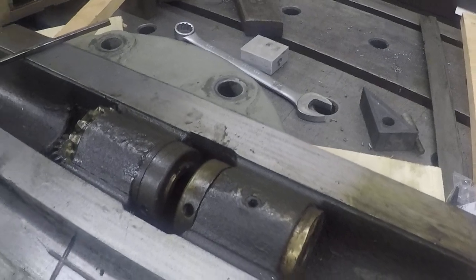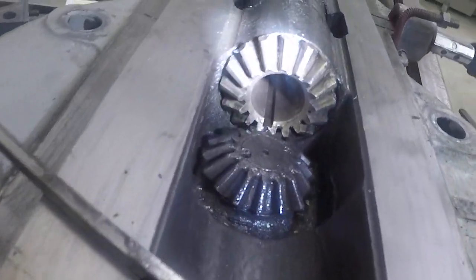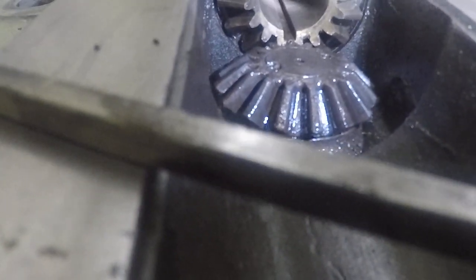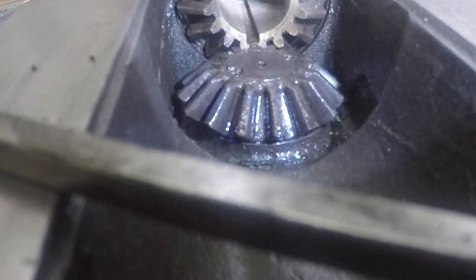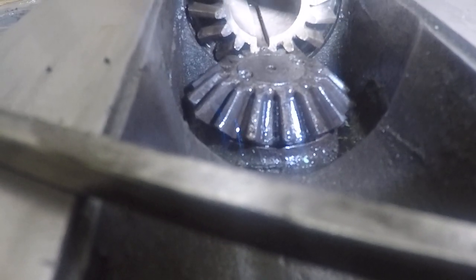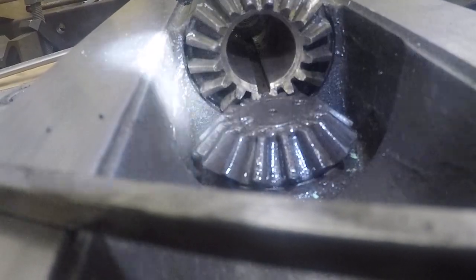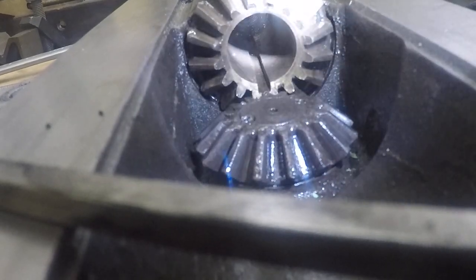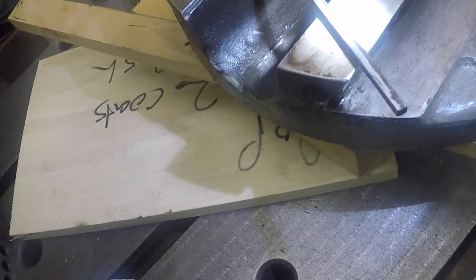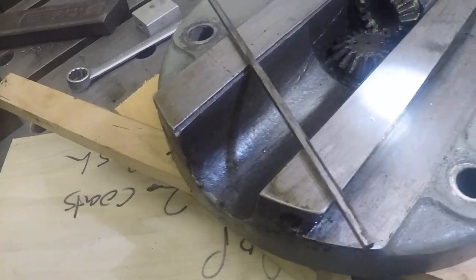The only thing I see holding it — I'm not really sure that's the cause — but it was round, down inside here. You can see the keyway almost to the other end; there looks like a round post sticking up, but it's flat with the bottom. I can slide this keyway all the way up and down. What I'm thinking is the original key had a round protrusion on the side, and this key stuck into that hole, which captured it and kept it from going up and down.